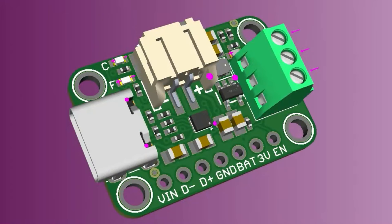This is another little board made with that same chip, except this one has a 3.3-volt buck output, so it's an all-in-one battery board for 3.3 volts with LiFePO4.